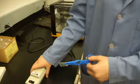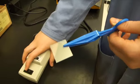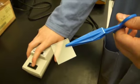To make them, we're going to need to use blackberry juice, a microscope slide, titanium dioxide, and an iodine solution. The type of microscope slide that we'll be using is coated on one side with a special conductive oxide. This will form one side of the solar cell. So the first thing we have to do is determine which side has the conductive oxide.